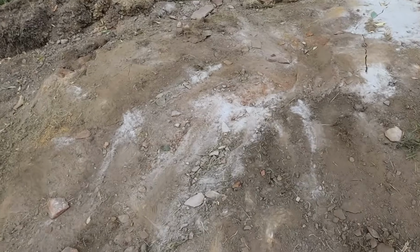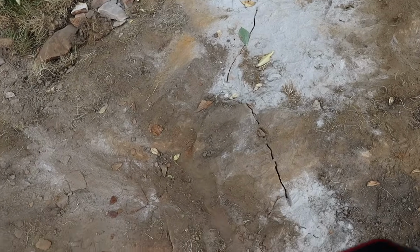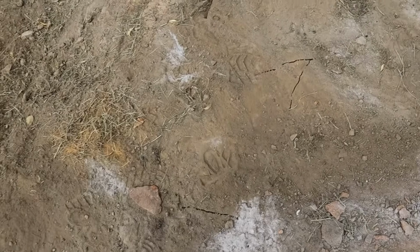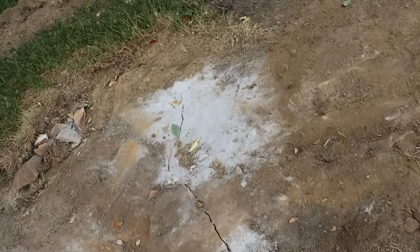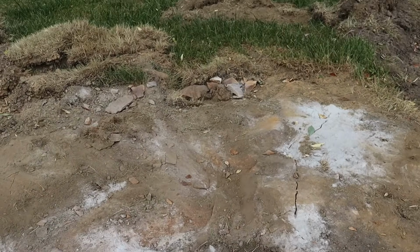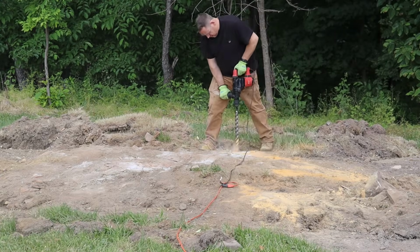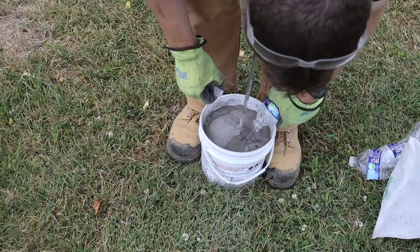The Dexpan absolutely worked for the small rock. We were able to get that one out. And in this really huge rock, even though we only used the 1 inch holes, it did put some pretty big cracks in here, but it wasn't enough to break it apart. And so now that I have a little bit more confidence in the Dexpan, I invested in a 1.5 inch drill bit, and I'm going to go round 2 on this thing, drill the 1.5 inch holes, and then put the Dexpan in. Hopefully that'll finish breaking this up.